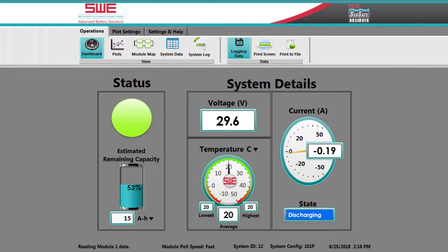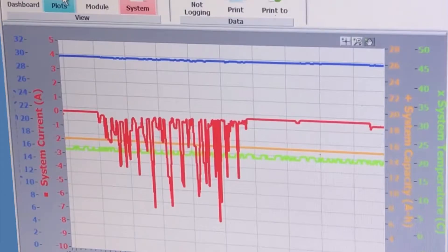This is being reported from the battery management system. When we look at the chart, this is a prior load that I have profiled. You can see the load of the inverter turning on here with the negative direction of the red current line. However, the battery stays very stable during this current pulse.